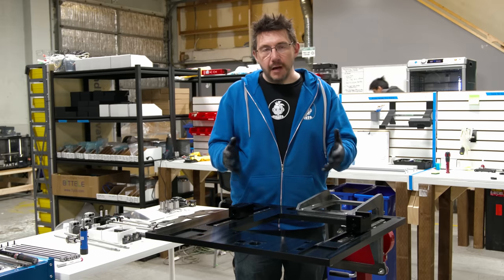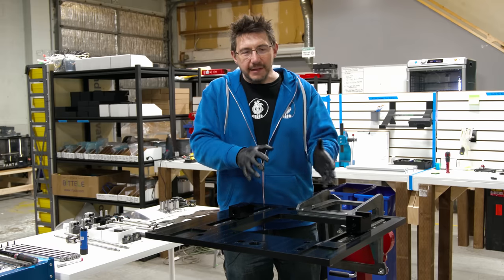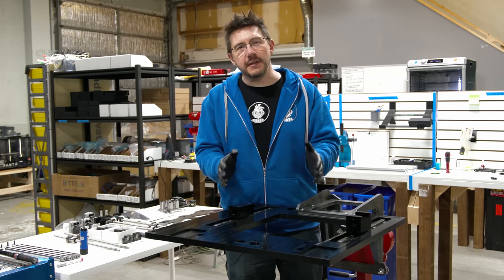We've completed a few steps, and honestly, I'm sort of just in wonderland here, because anytime I've assembled a 3D printer before, it hasn't been to this level of precision. I found out that the bearings and the screws for the HS3 are over-specced, and Pantheon did that because they want to ensure that it's reliable for decades.